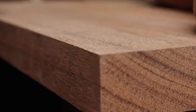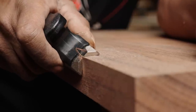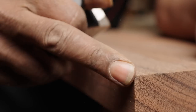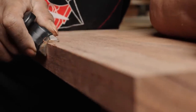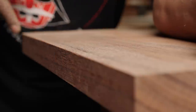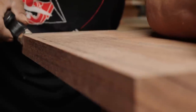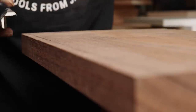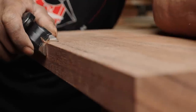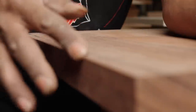This is a bit of Jarrah worktop. This is the 0.6 mil grip type. Very nice — so I can go with the 1 mil now. Just keep an eye on the grain, seeing which direction it's going in. So that's the 0.6 mil done quite well, so I can go with the 1 mil now. I have a beautiful chamfer there.